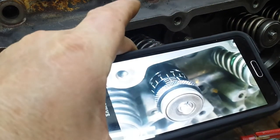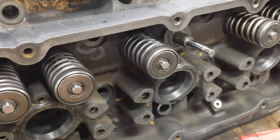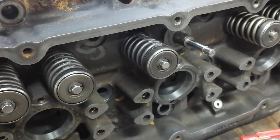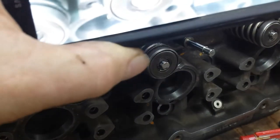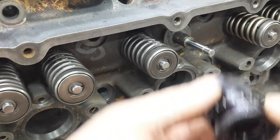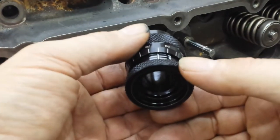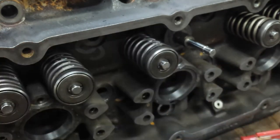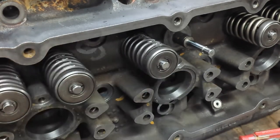Now, there's the picture of our micrometer. So we're going to match it up on here. Then we'll mic it out. So it's 1.9. Oh, is that 1.9? Right at 6.5. 1.965. There's our duplicate. Gosh, come on, focus. There we go. There's our dimension. Now that says, reading that, 1.965.